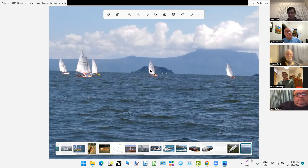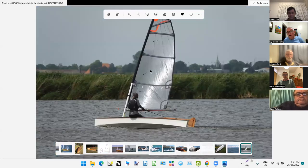Paul was pulling away from the other boats too — we could see every time a gust hit they would slide sideways a bit more. As boats get bigger it's not so possible to do this; on a bigger yacht it can be really unwieldy to try and dump the mainsheet or traveler, so you have to pinch the boat. But for our size of boat it makes a lot of sense just to keep the boat flat by using the sheet. It's also really easy to teach — one person on the mainsheet, the other steering, and the boat goes upwind, feels really good, real feedback.